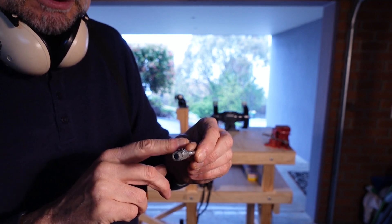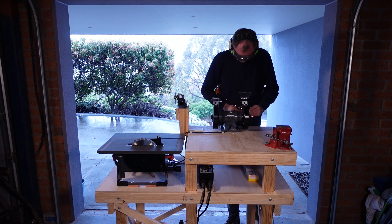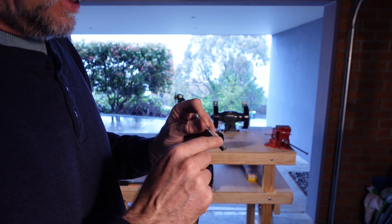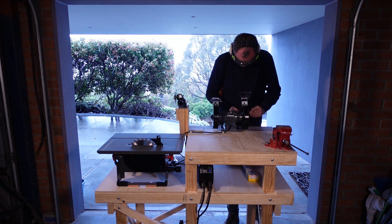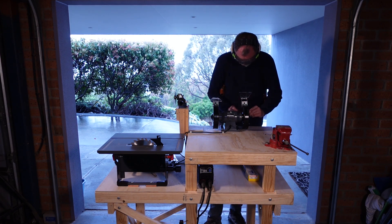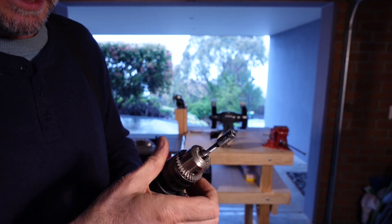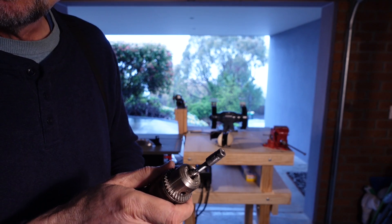The first step of prettying up the truss rod nut is to clean up this bead of weld. Next I'll facet the hex points off so that we can make this a little bit more circular. I've now chucked it up in my drill, and I'm going to spin it against the grinder to get the barrel nice and circular, and to also give a bit of a bullet taper to the end of the nut.